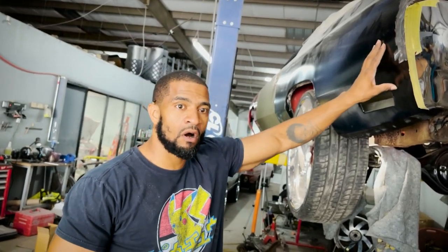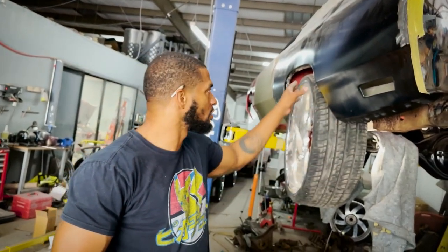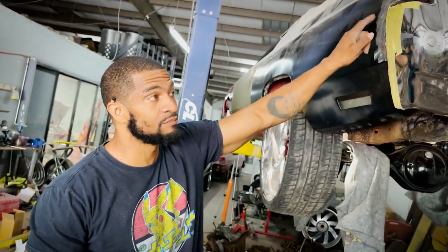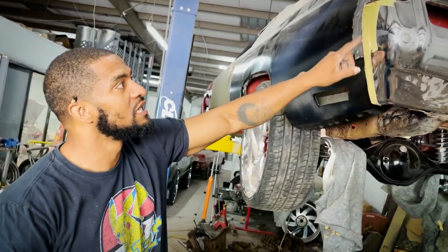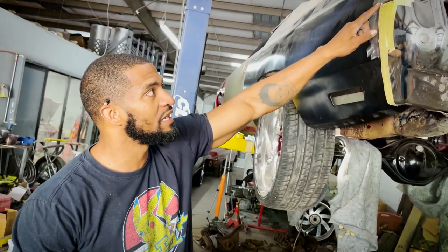Any piece of a car that meets another panel has got to be fitted before paint. Skirts, doors, anything trim that meets another piece of a panel that's metalwork, like this quarter was metalwork and this is a trim piece that meets it. It has to be bolted up to double check, because we've said it 100 times: